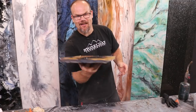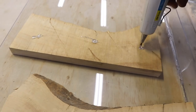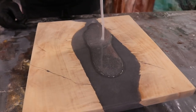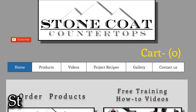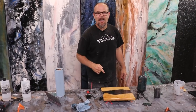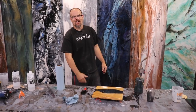Let's recap — this is a fun project and the steps are simple. First, we built a form. Then we sealed our edges. After that, we poured the river tinted with black metallic — you can choose any color to accentuate your project. After that, we did our seal coats and then finally our flood coat. Visit us anytime at StoneCoatCounterTops.com and check out our woodworking school projects. Get yours right now, because this project will open your mind to the possibilities of woodworking and epoxy.